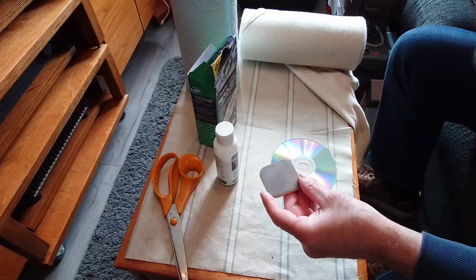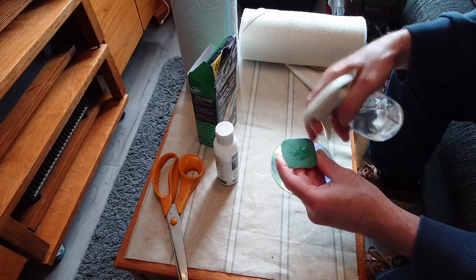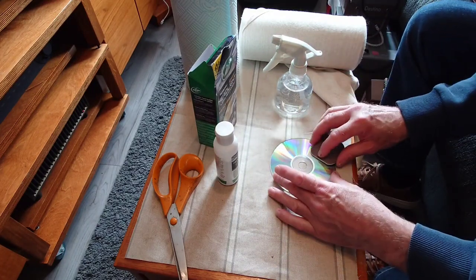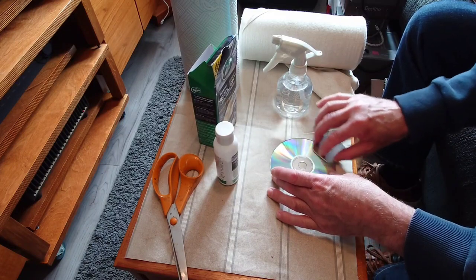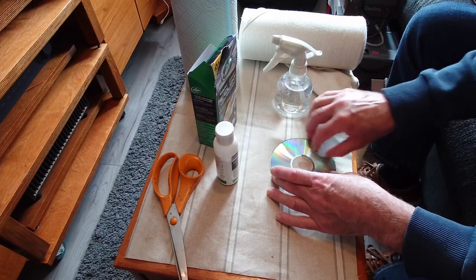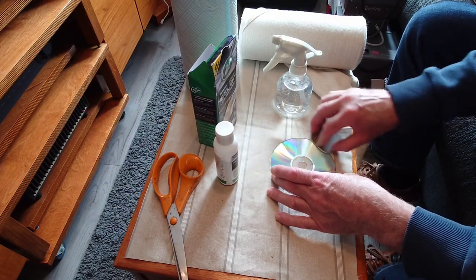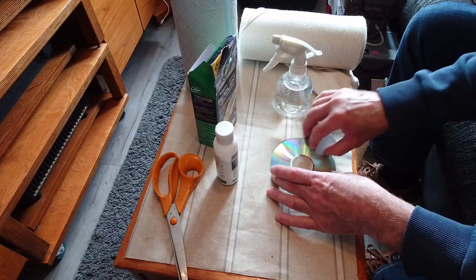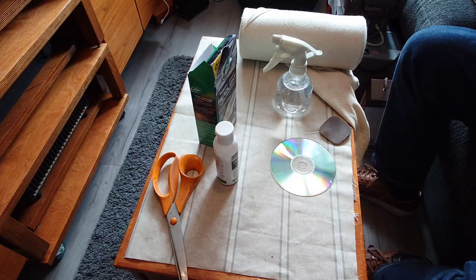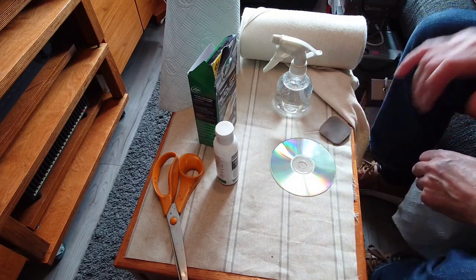We've also got a water sprayer filled with distilled water. You can add a bit of washing up liquid to aid the buffing — I've got some in this distilled water. I'll just rub it around the disc and then you're just going to work this in circles. What you'll find is there'll be some minute scratches appearing on the surface, and the idea is to gradually reduce the scratches. When doing this you've got to keep it even all around the disc — you don't want dips in one part.